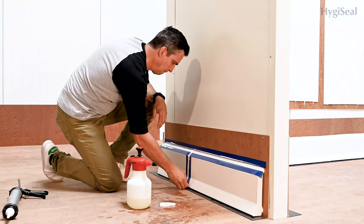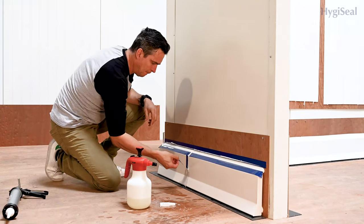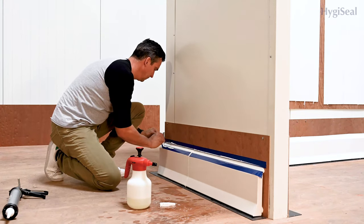When this step is finished and the result looks smooth, it is time to remove the tape. Remove the tape by pulling it towards the joint — the right tape is pulled to the left and the left tape to the right. By doing it this way, it gives the best result.